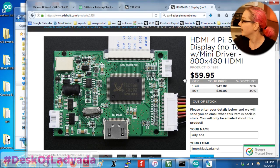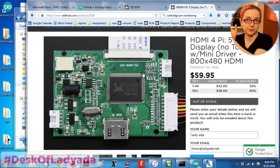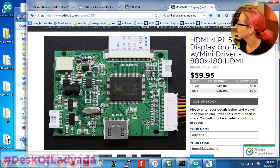This is an HDMI in to TTL 50-pin out. It's very basic. It's got the HDMI input and the TTL output, and you can even see groups of pins, like red, green and blue. The pinout for the connector is very well defined. These pins are very easy to reverse engineer because you're like, okay, it's going to be red 1, red 2, red 3, green 1, green 2, 8 bits, blue, and then clock, bit clock, vsync, hsync, and you have data enable, and sometimes there are a couple of pins other than that.